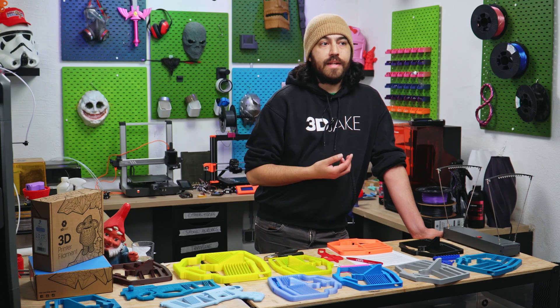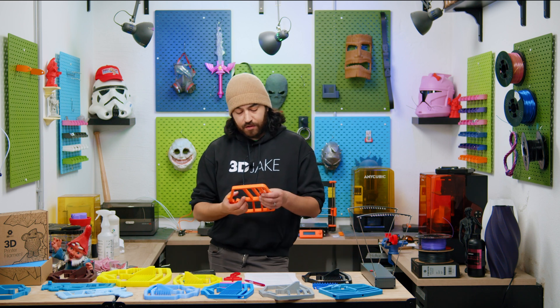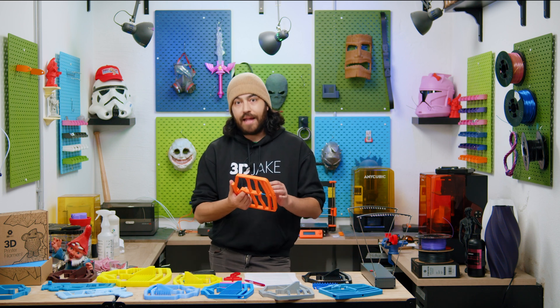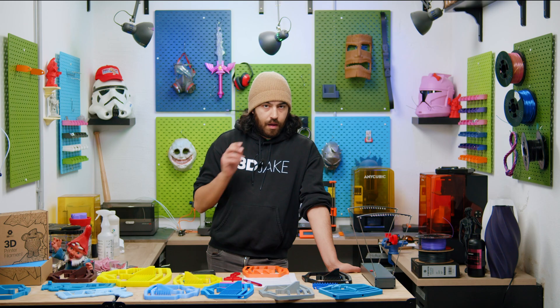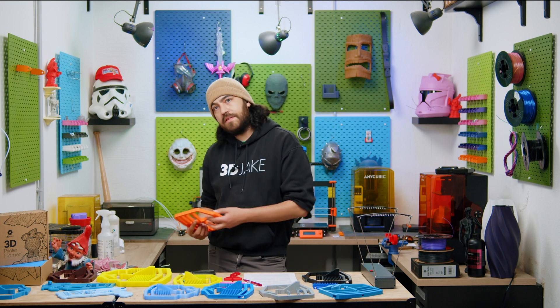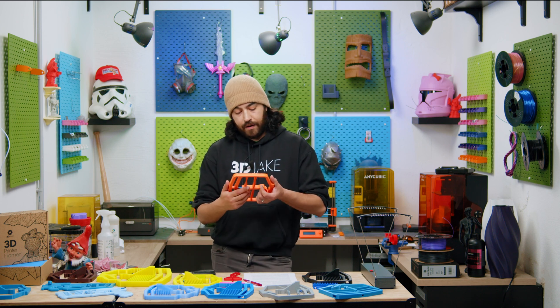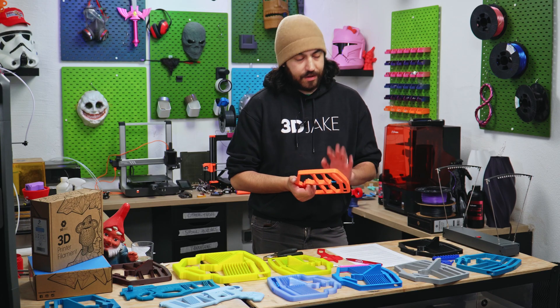So what about PCTG? Well, PCTG actually has a lower Young's modulus than PETG, so in hindsight I can understand why it didn't work. Should I use carbon fiber? With the bow we made, it was pretty long — we had a lot of lever action for it to bend. The issue here is that the parts are quite thin and they bend a lot relative to their size, so carbon fiber probably wouldn't be a good choice. ABS also has a very similar Young's modulus to PETG, but ABS has a low yield strength — it will work until it deforms permanently and you can't use it anymore.